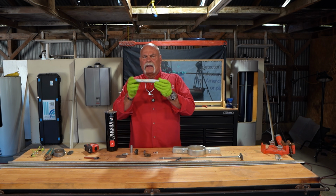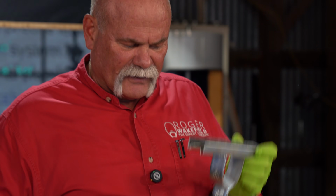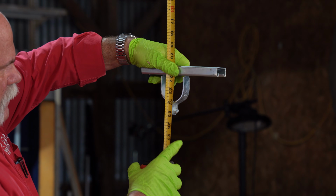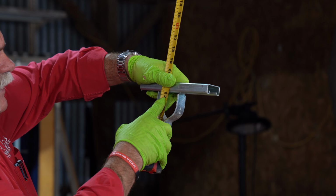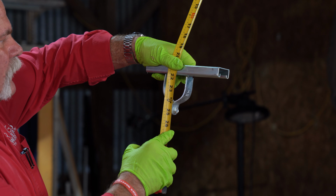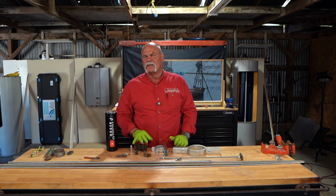So you're doing an inverted line where you're hanging a bunch of stainless lines or something. It's about the same. You're going to look at where you want your 24 inches, and you're going to come up and say, okay, if I need an inch below this to get my washer, now you're looking at 22 3/4 inches to give you a full inch for your washer and your nut to tighten it up.